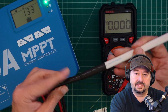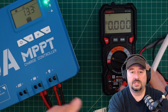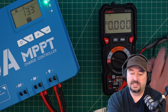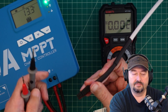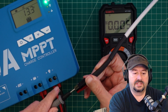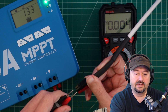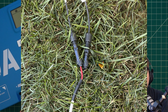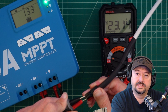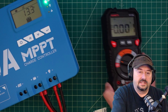This cable is a marine-grade outdoor cable and it's about 25 feet long, so we do get some loss through it as it comes in, but it works really well for outdoor applications. I wanted to check the voltage coming in off the solar panel right now — I'll roll a picture in so you can see how I connected the panel to the cable. We're seeing an open voltage of about 23 volts. Let's get this connected to our controller.